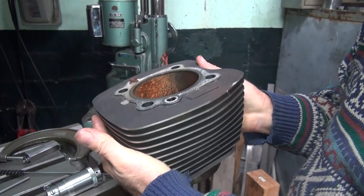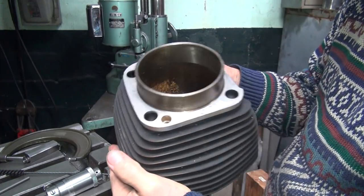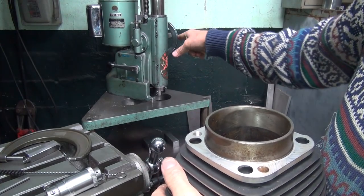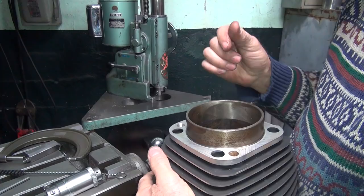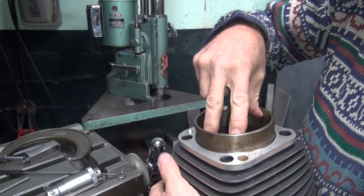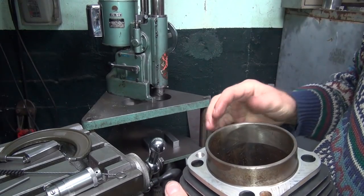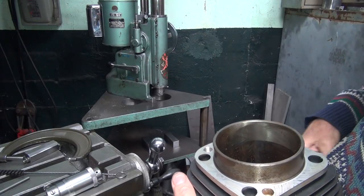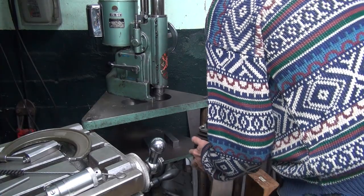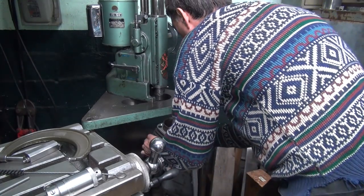You push the gasket surface against that top plate, and that's what centers the cylinder so it's not cocked sideways. If you come off this surface it might not be straight to the other side. This side bolts to the case - that's the side you want to come off of because that's where accuracy comes in. Once you get this bolted up and make sure it's flat, you adjust the boring bar to center the cylinder using three pins that expand out three ways to center it side to side. You can make fine adjustments if it's not quite on center. Also make sure you don't run your boring bar into the table down here - not a good idea.